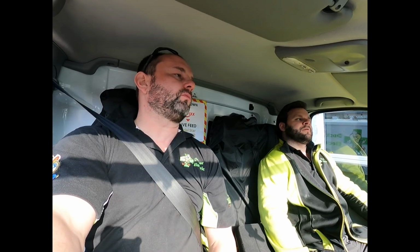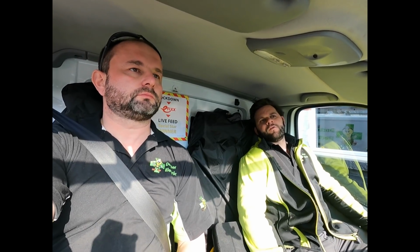What have we learnt today? What's the learn of the day? Learn of the day is when you're torquing a consumer unit up, check that it doesn't over-torque, but it was torqued to the right settings. So that's an odd one, isn't it? To be fair, it's probably my fault. I should have probably re-terminated that lighting circuit. So it just snapped when Adam was torquing it. It couldn't handle the torque. You happy?